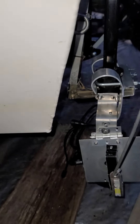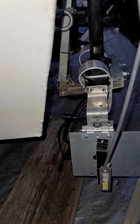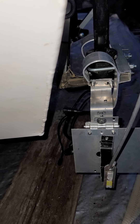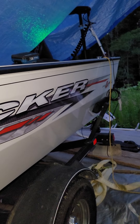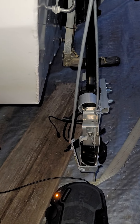I'd like to put it back in the boat in the stowed position. It's straight forward and as you come up slowly with your foot, you'll be able to see your bottom on your screen. You can level it out where your bottom is straight across on your Solix screen — so it's not narrow on one side and tall on the other side. It'll be the same distance from the top of the screen to the bottom all the way across just by making a few little touches on your foot control. Now I'm going to show you this joystick I got right here. I'm going to take that joystick and put it in landscape mode. You should have been able to see that — I put it in landscape.